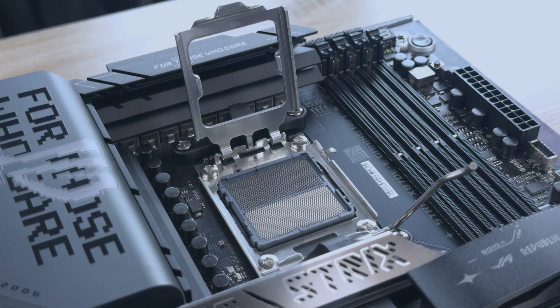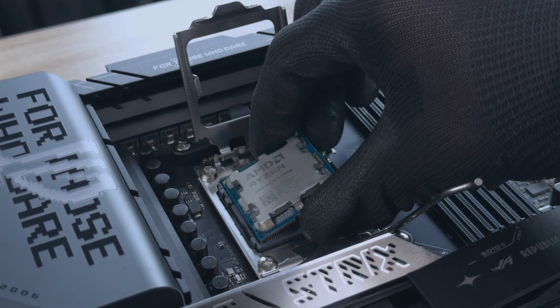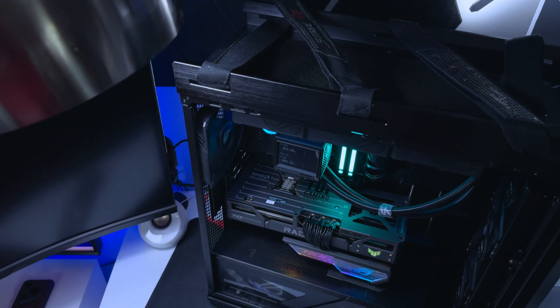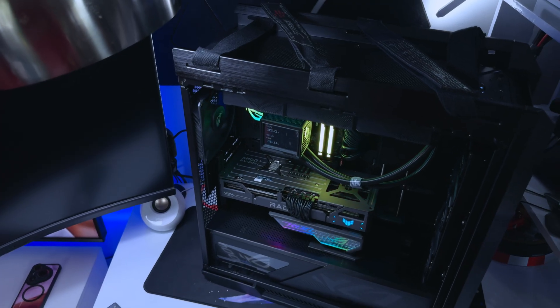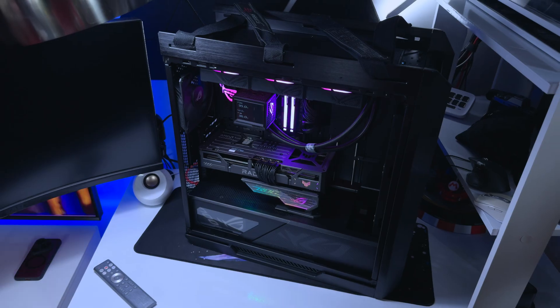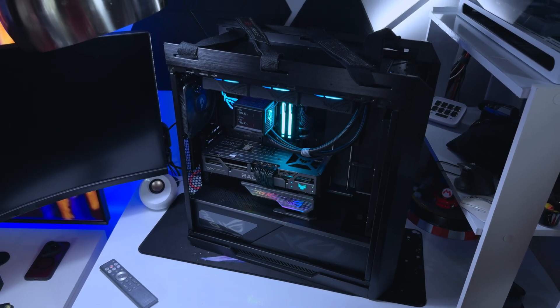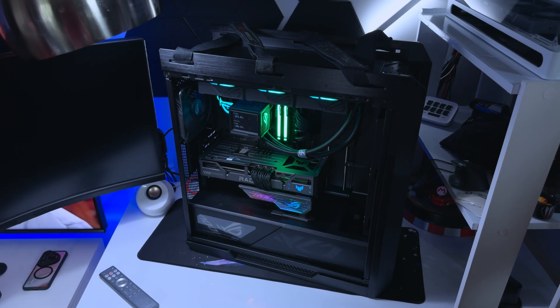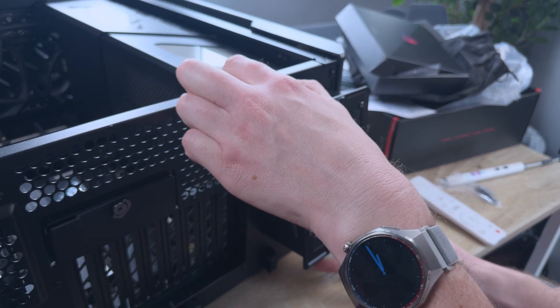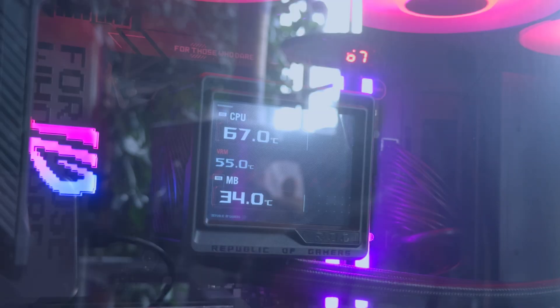For the benchmarks I'm using an AMD Ryzen 9 9950X cooled by the Ryujin 360 Xtreme cooler. I installed 32GB of RAM, but the board does support up to 256GB of DDR5 RAM with speeds of up to 8000 MT/s. Power delivery on this motherboard features 22 phases, 18 dedicated to the v-core, with 1980 amps — which can easily support overclocking any flagship CPU.